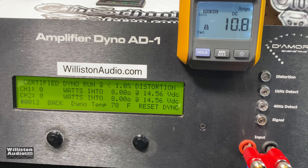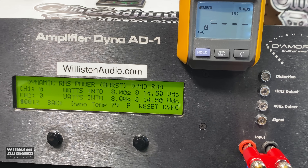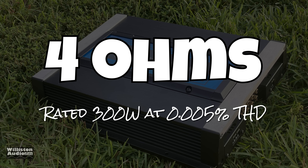The amp doesn't even show an 8-ohm rating, but we decided to go ahead and test at 8 ohms at right around 14.5 volts. We get 278 watts certified at 14.34 volts — very nice, actually very close to the 4-ohm rating. Uncertified takes it up to the clipping point; with power guard enabled it will not allow hard clipping, giving 282 watts at 14.34. The dynamic run shows 284, 285, 286 watts at 14.38 volts. Calculated efficiency: 64.2%, about what's expected for a class AB amplifier.